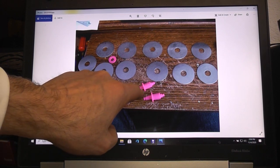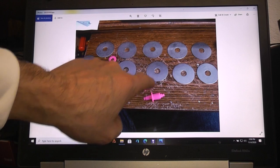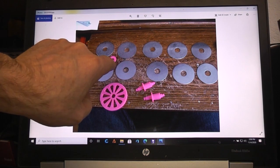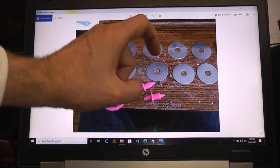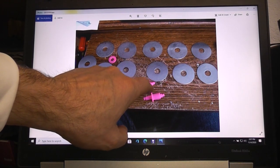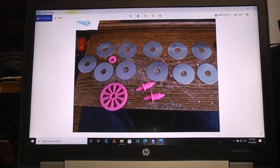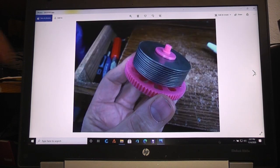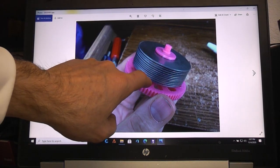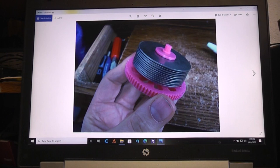The gear gets glued on one side, and then a ridge forms a place to start slipping the washers on. You can stack as many washers as you can fit, then an end cap piece gets glued on to secure them. If your washers are a sloppy fit, wrap a little electrical tape around the shaft - you want them snug so the weight doesn't get funky. I also put a little drop of glue between each washer so they wouldn't spin individually, making one big solid mass.